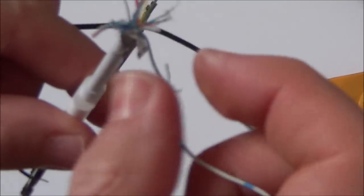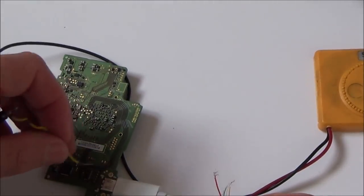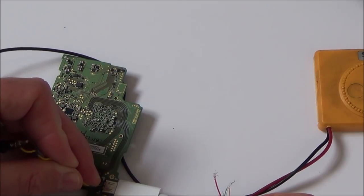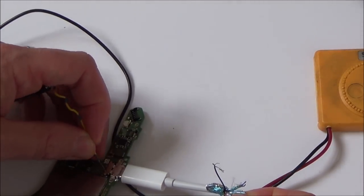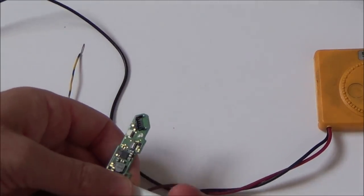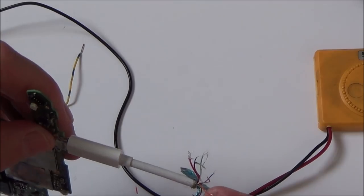When I go onto these smaller wires, for example the orange wire here, they will only have continuity on one side, depending on which way the connector's in. The connector's in this side now, and I've got continuity on the back of the board. There. Okay. But now if I do this side, there is no continuity. And when I swap this over and put it in the other way around, then I will have continuity on the opposite side of the board. So I suppose that makes sense.